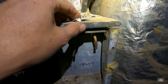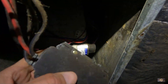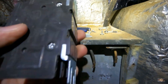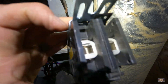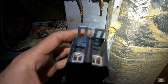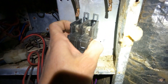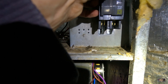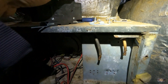I killed power coming in here. These are the kind of clips that were on the old one at the top and the bottom — they hooked into the gaps at the bottom and top, but they won't work on this new one I have. It's a Goodman OEM inline breaker for a heat kit, but the tabs on these — the wings — are too fat and won't match up. But it comes with these brackets. You just put the brackets on, they slide in like that, you slide this in here, and you've got screw holes there at the top and at the bottom. So I'm going to go ahead and mount this thing and then we'll wire it up.